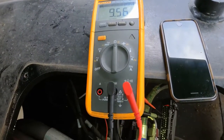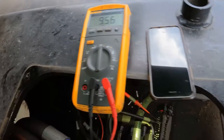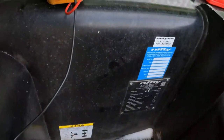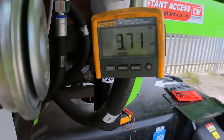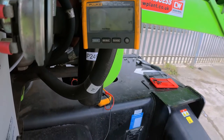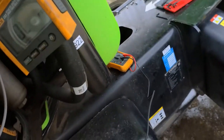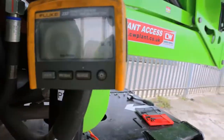10 kilo-ohms means the PLC is not connected to the CAN bus into the main box. I'll try to measure resistance to find out which line is not connected. I still have my red wire on pin 25 - measuring on CAN high I get 9 kilo-ohms, and on CAN low I still have 9 kilo-ohms. So pin 25 is likely not connected. I'll move to pin 26 - measuring CAN high gives 0.3 ohms and CAN low gives 60 ohms.